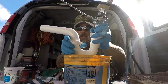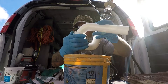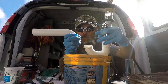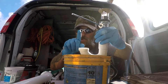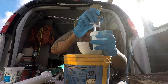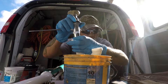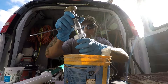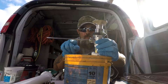Get yourself a bucket and loosen up the P-trap — put the bucket underneath it. Take and loosen your P-trap up. Now this part is going to stay in the wall; I'm just disconnecting this piece. Remember P-traps hold water to keep sewer gas out. Take and remove the top part of this P-trap over a bucket because there's going to be water inside of here. Pull that P-trap out of there.